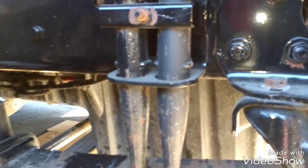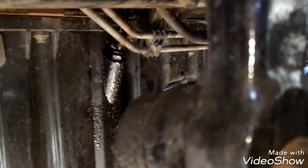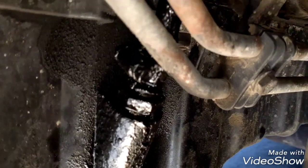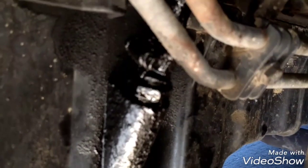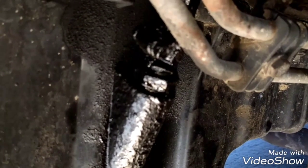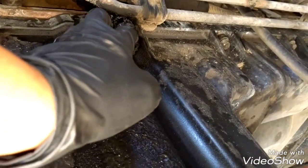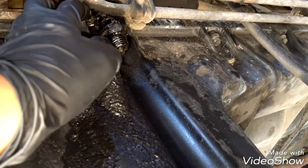The vehicle is up. To remove the oil pump, the first thing we need to do is to remove the oil distribution hose right there by loosening that clamp and loosening that nut that's holding the distribution hose on the oil pump. The oil distribution nut and hose are out.